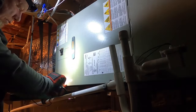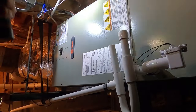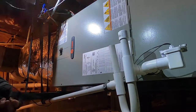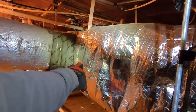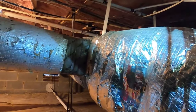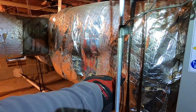Basically the old mystery of dirty sock syndrome. This unit has a new return plenum on it. When we put this in we did replace it and connect it to the original trunk. I'd like to get my camera and scope in there and see what condition this old trunk line is in — it runs all the way down and branches off. We did replace the supply plenum transition that connects to it.